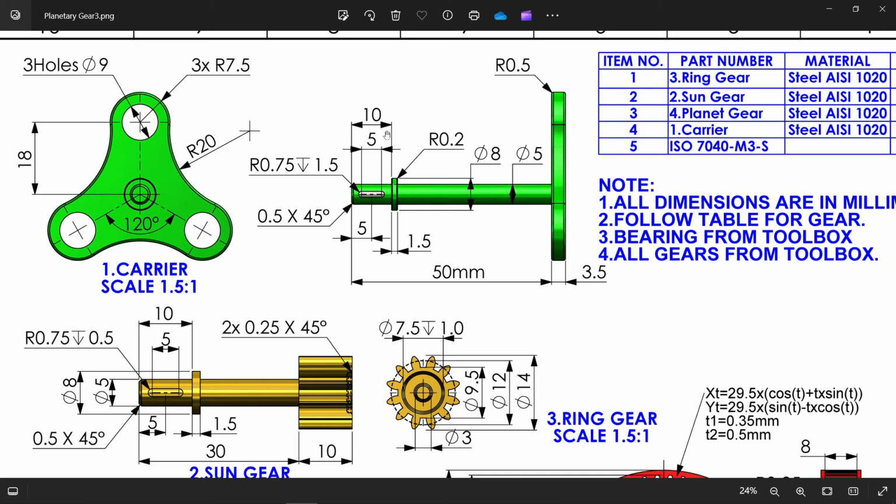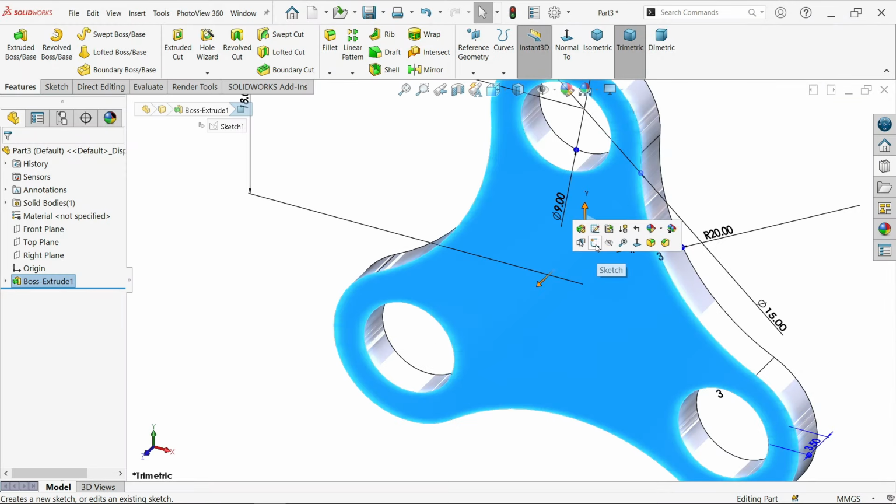You will see there is a 1.8 diameter and 1.5 thickness. Corner radius also shown 0.5, and then there is one oblong hole, R 0.75, with a cutout depth of 1.5. Okay, chamfer 0.5, 45 degrees. Then this corner also has 0.5.